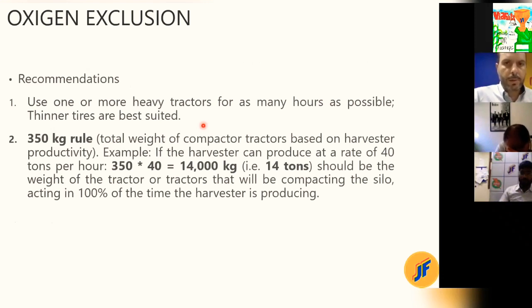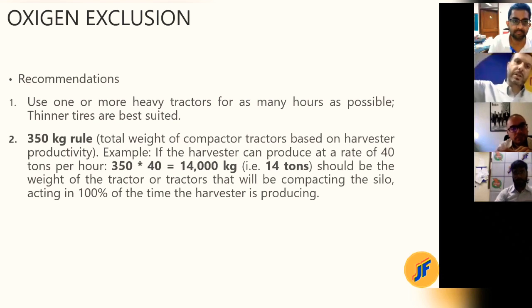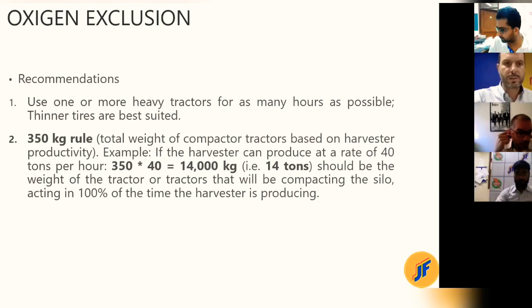Mauricio, one addition here, sorry. Here in Brazil, it's very common bunker silage, but in India, there are a lot of people that make silage in bags or bales. So one very interesting machine that Vidhata makes there is the Silo Pack 4D and 1D. If I remember, it has a hydraulic cylinder, and this cylinder presses down into the bag. So this helps a lot in oxygen exclusion, for having a better quality silage.